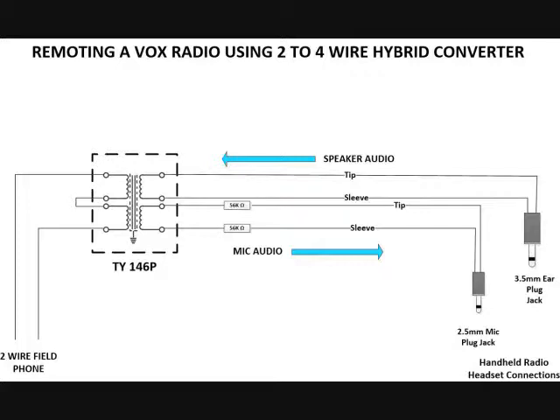On the other side of the transformer you'll notice the two tap points that are jumpered together, with one of our two wires going to the top one and one going to the bottom one. This is the 600 ohm side — the side that connects to the field wire and to the field phone itself. This is basically how your home telephone works: it's got a two-wire to four-wire transformer in it that takes the two wires coming out of the wall plug and allows you to connect a handset and microphone on the four-wire side.